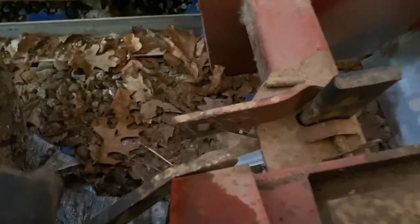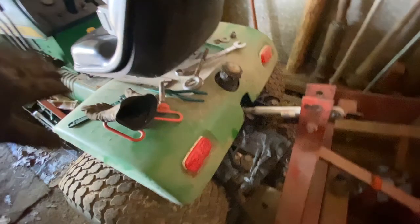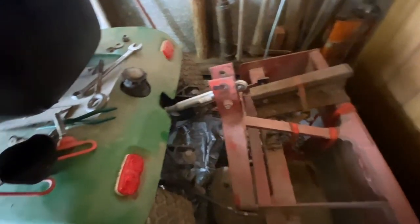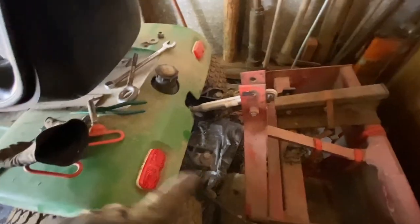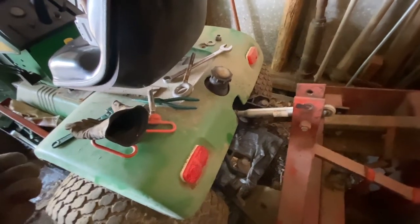This is disconnected. This one's disconnected. And that one — that's the three points of a three-point hitch. All we have to do now is pull the tractor forward and this will just stay behind. We're not going to do that yet, but that's how you disconnect it. And then you would repeat that process when you back up to another implement.